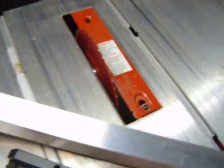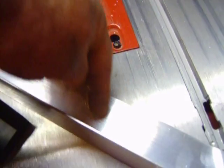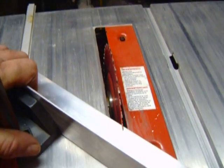Let's say I was going to make that next cut. I'm going to make it 19 inches long. I'd change my setting over here to the other side, loosen this off to make my opposite cut, and then I'd bring this over here and say I had it marked off 19 inches right here, and then I'd draw a line on it like that, and then I'd push it through. And I'm not going to, because I don't have my glass out here, but I hope you guys get it. Both of those angles would turn in like that on both sides.